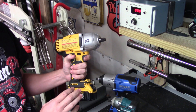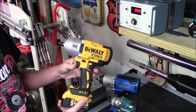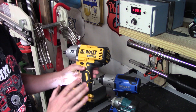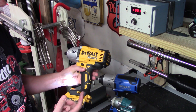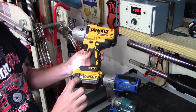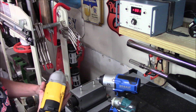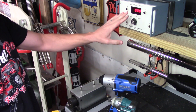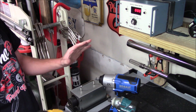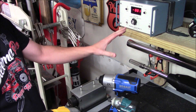To show you firsthand what dynamic torque is and how much lower it is than working torque after 15 seconds, here's the DeWalt DCF899. This is more powerful than the Milwaukee, coming in at just over 1,000 foot-pounds of working torque in reverse on the standard Skidmore after 15 seconds — with a 5 amp-hour fully charged battery pack for maximum power. We're going to look at the actual dynamic torque with the T3000 in both forward and reverse.